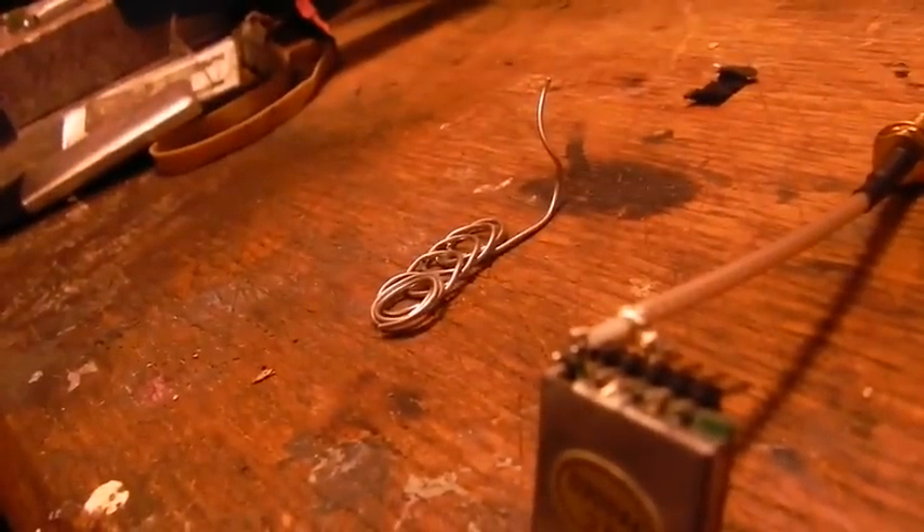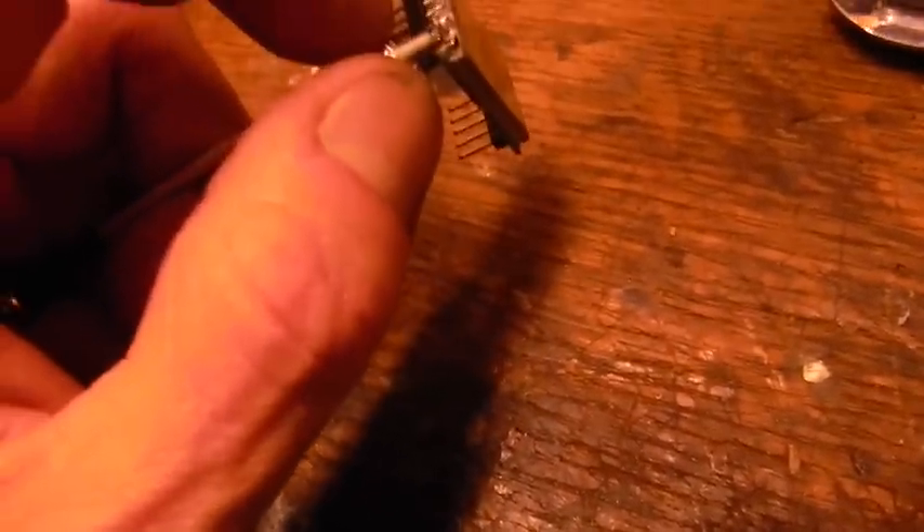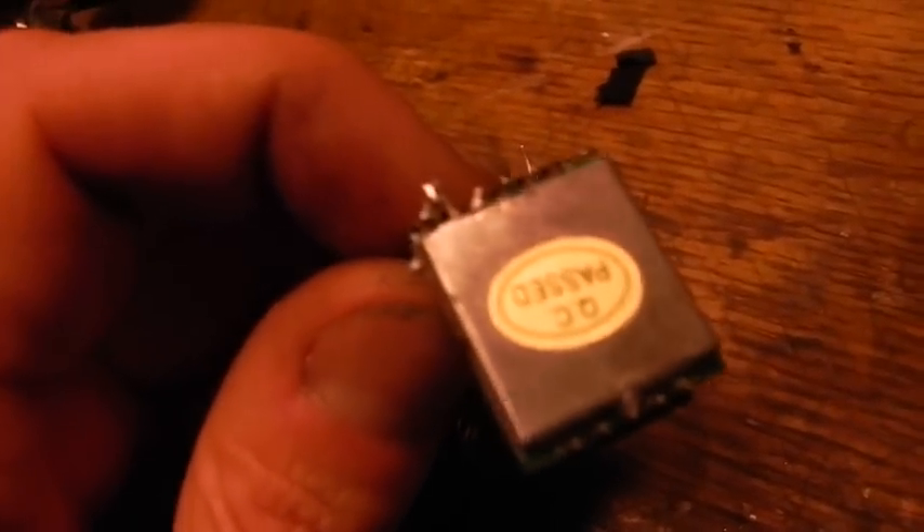And there we have it soldered now. I wanted to show you the technique I used. The shielding I've moved to the sides — the ground on each side — and then the center piece I just left a very tiny, small piece here and joined that together. Then we're going to glue-stick this one end so it's firmly in place. The ground wires are what's holding this together, so if I pull on it, it's bearing the weight on these two wires, so that the center crucial point is supported by those two outer wires, and that'll keep it safe from being damaged.